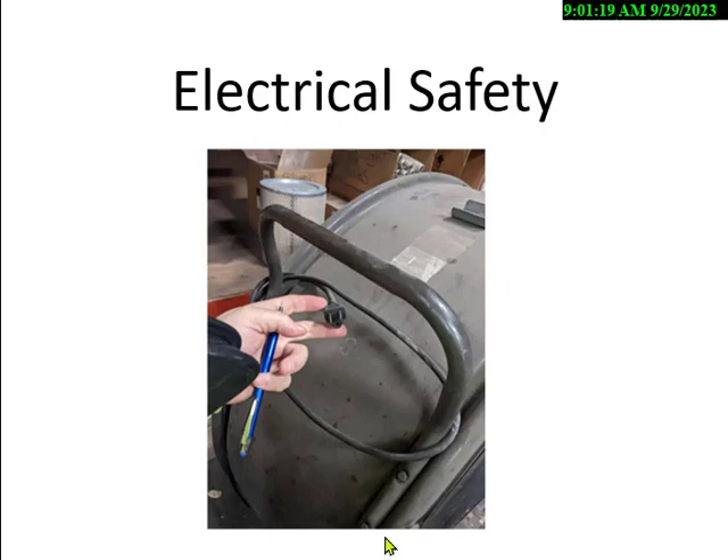As a Dayton fan example, we are missing the ground prong — the term in electrical is the 'grounding conductor.' In 1929, the Electrical Code required this third wire ground wire to take some of the current, hopefully most of it, away from a person getting shocked with an electric drill or metal fan. If you have that third wire, most of the current will go to earth and you'll get some shock, but hopefully not enough to kill you.